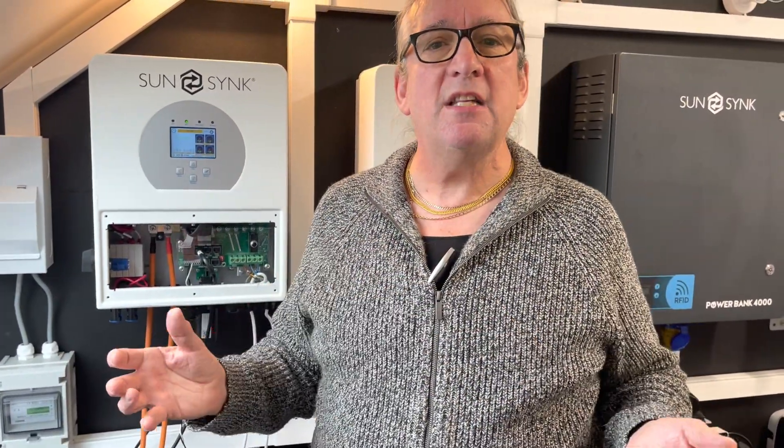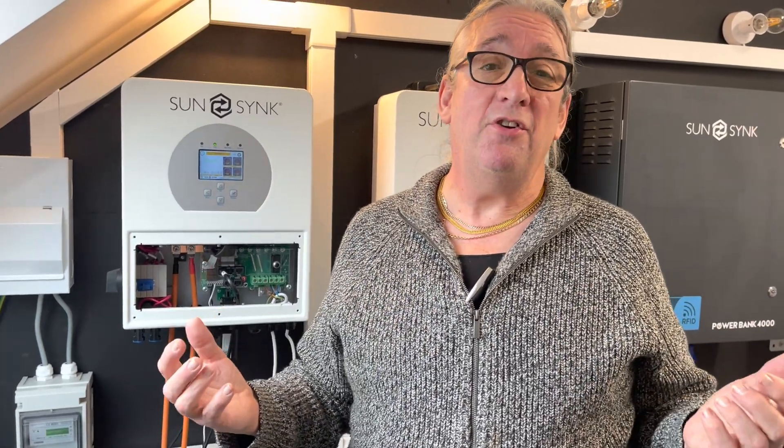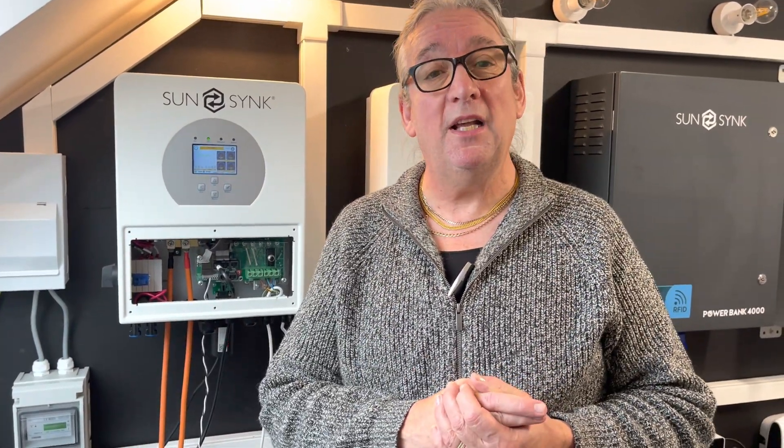It can discharge the battery too. It doesn't have a separate charger circuit — it's an all-in-one unit that reverses, going backwards and forwards. This beast has over 7 kilowatt MPPT, meaning you can put 7,000 watts of solar panels on your roof — enough power to charge the batteries and use in the daytime. It's AC coupled, DC coupled, everything coupled. You can use a generator, use it off-grid or on-grid.